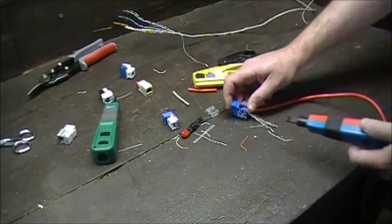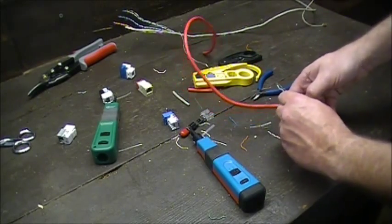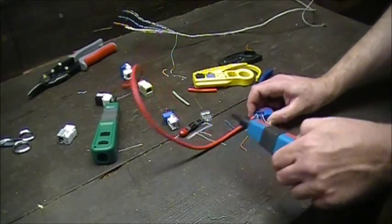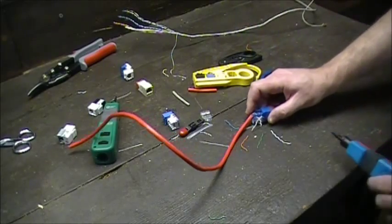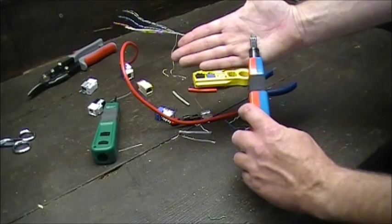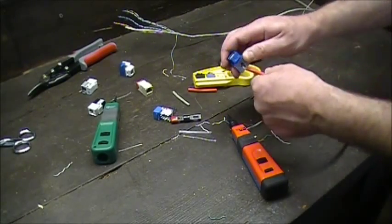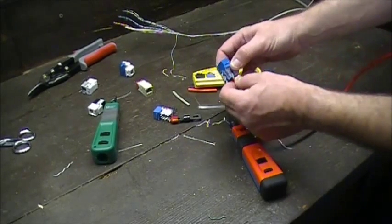If you go straight down you may get some hangers — wires that don't cut clean. Take your thumb and place it in there. While I'm doing this, I want to show you how a jack is supposed to look — no string, no mess. If you adjust your blade to a slight angle toward the cut side, those excess wire ends pop right off. If you're doing a hundred drops you want to be fast; the boot or cap protects the cable and keeps things tidy.